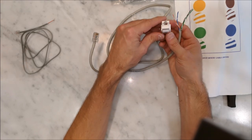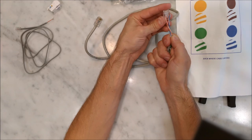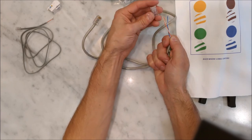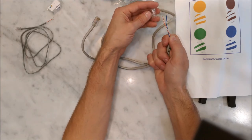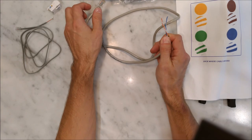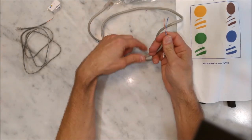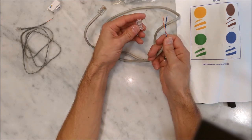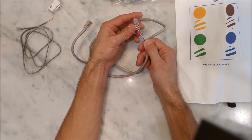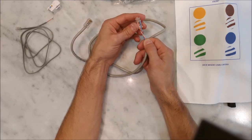Now if you only have four-wire wiring, you are still good and will still use this eight-plug RJ45 connection. Believe it or not, up to 100 megabits they only use four of the eight wires — even though network cables are always wired with all eight wires, up to 100 megabit they're only using four of them. So if you take your four-wire cable in your phone closet, you can still wire up this plug using only the four wires. There's a special order you need to follow, and I will put an image at the end, but if you wire up just the four wires in the right sequence—